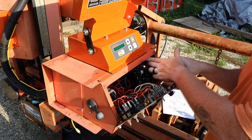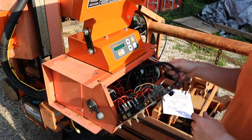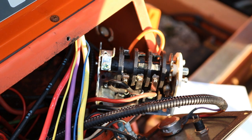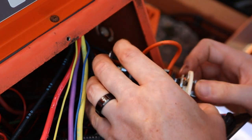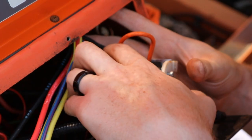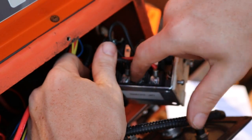I'm going to cover these wires so they won't abrade in this hole, because there's a lot of vibration in a sawmill and wires get ground out all the time. The instructions say to take the orange wire number 14 and the black wire number 15 from the up-down switch. The switch is marked 2, 4, 6 and 1, 3, 5, so you won't see a 14 or 15 there — you have to look on the wires themselves. On the orange wire there is a 14 stamped in black going all the way along it, and on the black wire there is a 15. Then it asks us to take these wires off and reconnect the terminal.